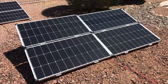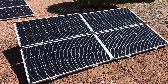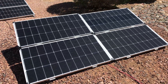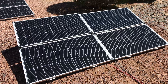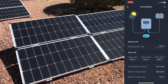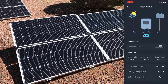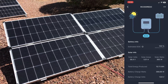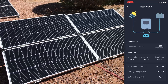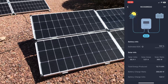Here's a look at the 400 watt array I built out of the four 100 watt CalSun solar panels, and it is really performing quite well. Connected to my Renogy system in my garage — these are all wired in series. You can see 66.3 volts, 5.51 amps, and it's putting out 365 watts. 366 watts out of a 400 watt array — that's pretty darn good.